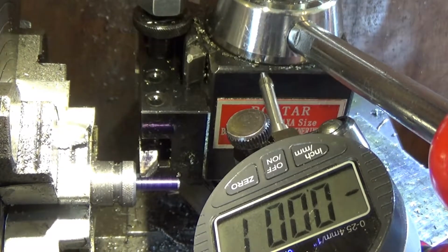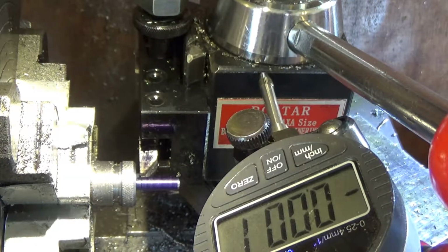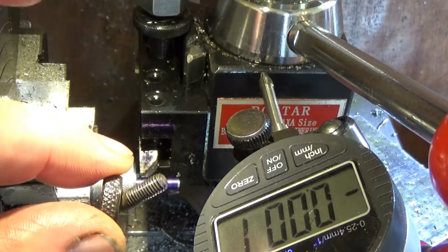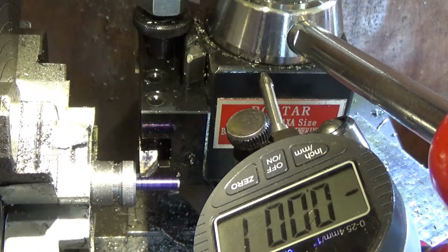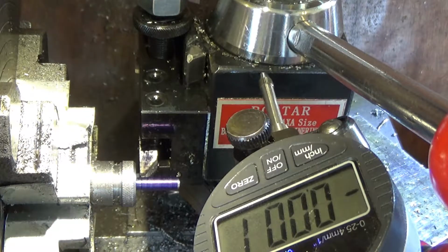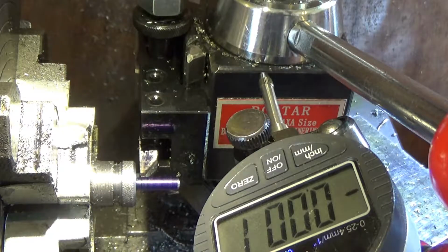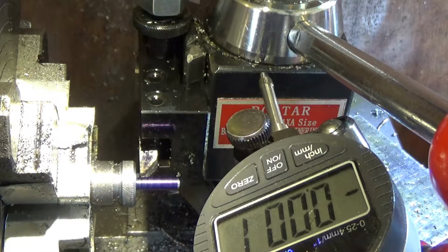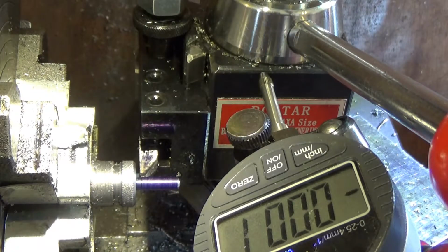Right, so this is the second part I'm doing today. As you can see, it is a representation of the original Bridgeport thing, which was bent, just needs some threads putting onto it. This one I'm not using a live centre, I'm only taking 10 thou total cut, and then whatever extra we need after we've measured it with the gauges. And this time I am going to 10 thou, I'm not going to go anything more than that.